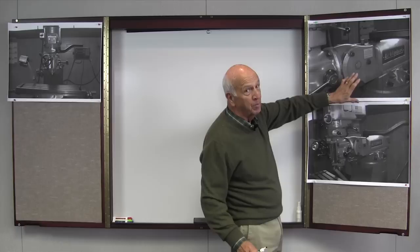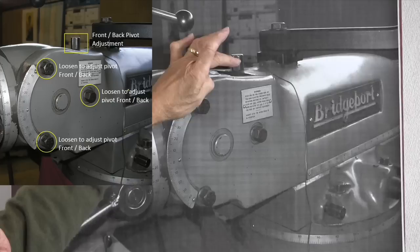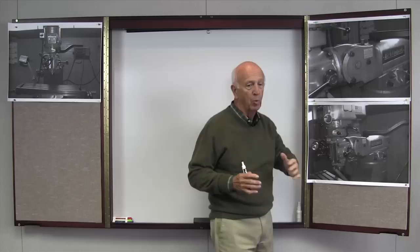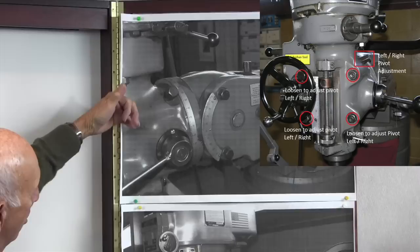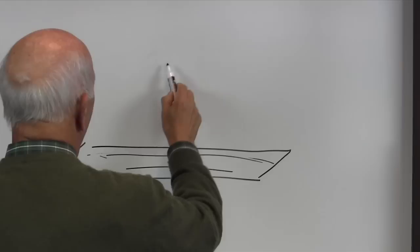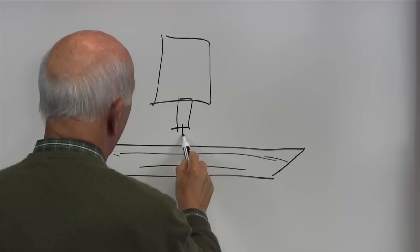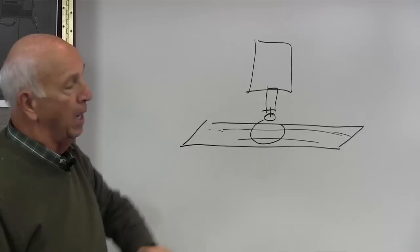It's pretty tricky because it's heavy and it moves when you don't want it to and it doesn't move when you want it to. There are three bolts here, and there's a worm screw right here to adjust up and down — or when you're facing the front of it, it tips forward and backward. Then this one is the exact opposite: it has a screw here and bolts on the other side, allowing rotation that way. So we came in here with our work head and spindle, put an indicator on and swept it all the way around — to the right, to the left, front, and back — then made our adjustments.